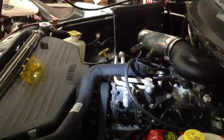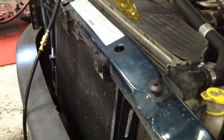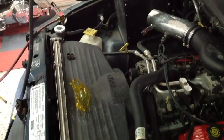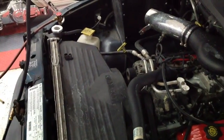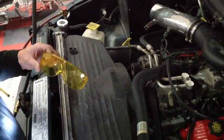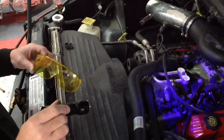I'm going to use my light to look for any leaks. I'm going to take a look around the condenser looking for any smoke at the fittings. I also have the ability to use the special glasses and use UV light, which makes it a lot easier to see high pressure leaks.